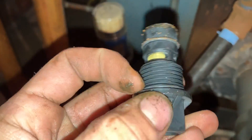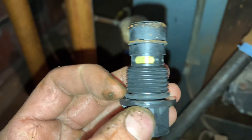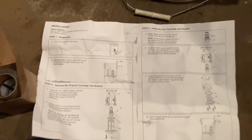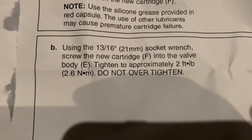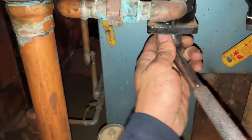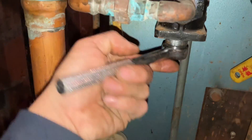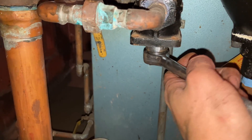This little o-ring right here — now look, this is only plastic so we don't have to put it in super tight. New cartridge going in. Here are the instructions and it actually says right here: tighten to approximately two foot-pounds, do not over-tighten. That's exactly what we are not gonna do. Go nice and slow — this is super loose, and once I feel any kind of tightness I'm gonna stop. Right there — that's it, done.